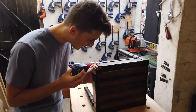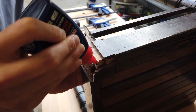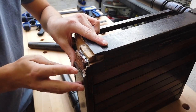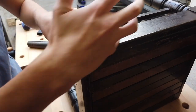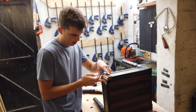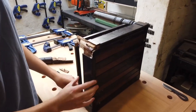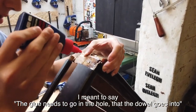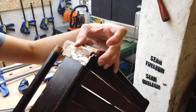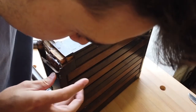First I'm going to put some glue down in the gap on the back side of the mortise and tenon. The good thing about this glue bottle is it has a nozzle on the front so I can direct where the glue goes. That looks like a good amount. It's fine if you have a bit of squeeze out — just make sure you wipe it. Depending on whether you want to keep the old finish on the piece, if the glue squeezes out you might need to sand it away, which might remove the finish. So if you want to keep the old finish, make sure you don't get a lot of squeeze out. Next I'm going to add glue into this dowel area — and it goes in nicely. Wipe away. It's pretty much like putting a puzzle together, fitting all the pieces and seeing where they go.